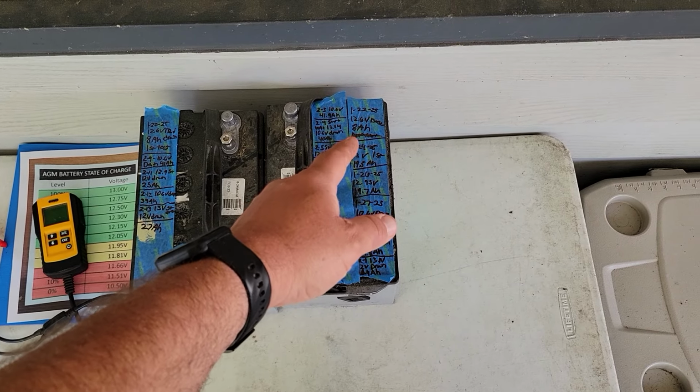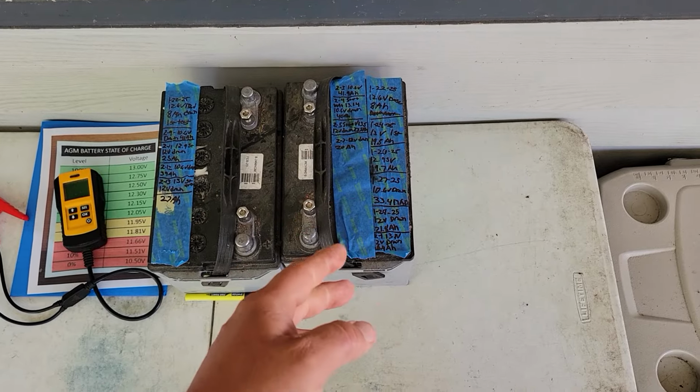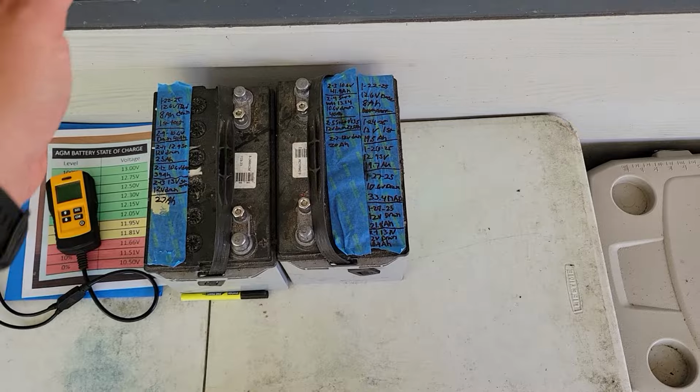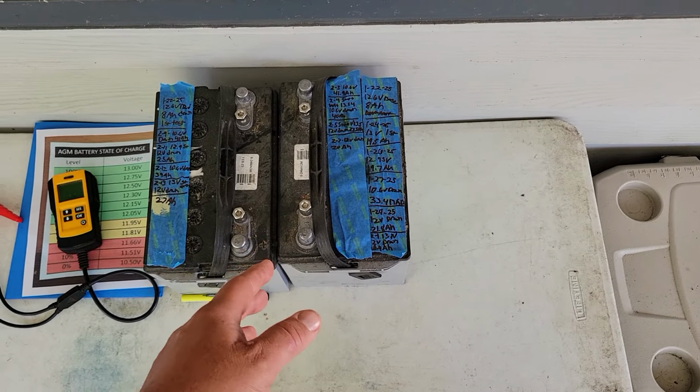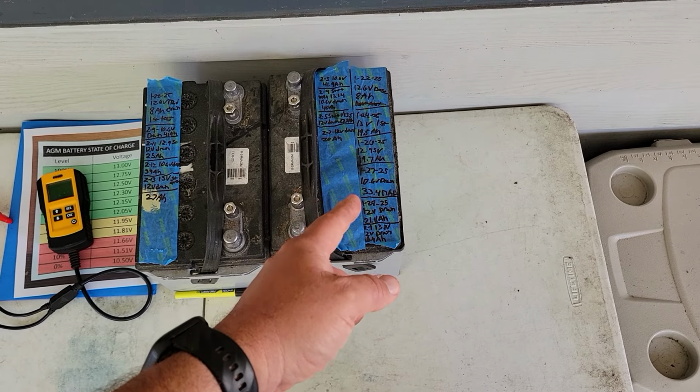I went from 8 amp hours to 19 and a half. Okay, so I did the test again. Didn't really get that much more after, we're talking more days have gone by. Same procedure. It went from 19 and a half to 19.7 amp hours.